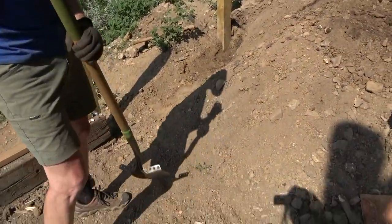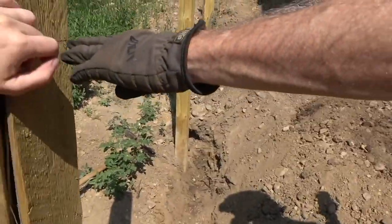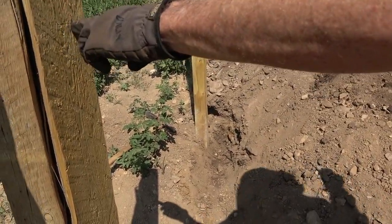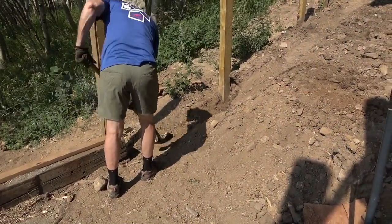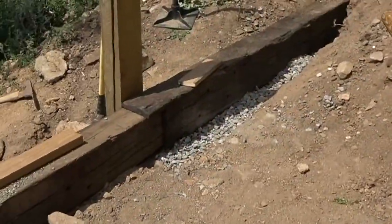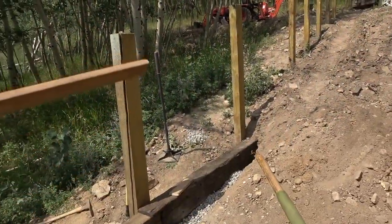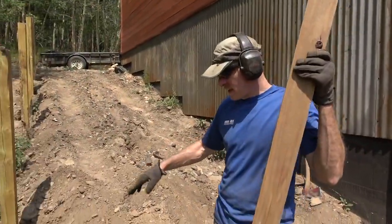The first thing you do, so you're just leveling it out to put your first tie in? Yeah, because the first one's going to sit on top of this one here, so the piece that's sticking out. I haven't measured yet, but maybe five ties here. So this line is level with this here. That was the difference in thickness. So you're going to stack up that whole section first before you, I see. Okay. Got it.